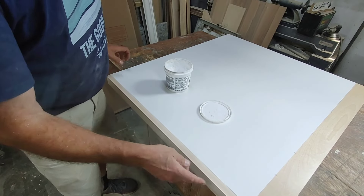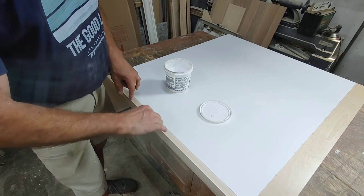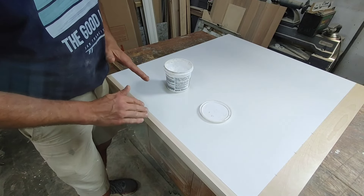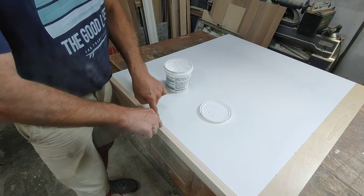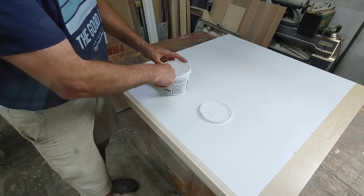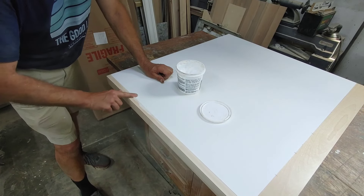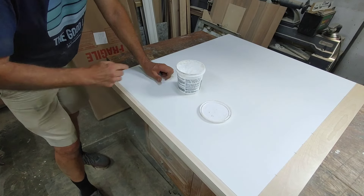At this point, here's one of the most important parts of this whole thing. If you were to paint this now, the paint goes into that little V groove right here, and if there's any point where it doesn't have any connection — meaning there's a little void, maybe the clamp didn't clamp well enough — what you need to do is what's called bridging. All you do is take some spackling and just fill it into the groove, going down the whole length of what you just did.